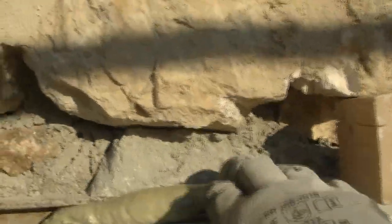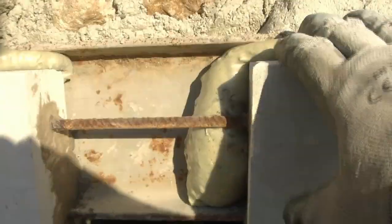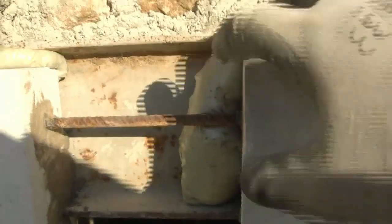What I've done is I've finished off the edge with a commercial foam, and that's not going to go anywhere. So that's just filled the gap. That stops any damp, that stops any creatures going through that steel and through the back of the stone. And it also beds the stone against the steel without the stone sitting on the steel, like the first solution of the rubberized compound did. And so that's the internal joint.